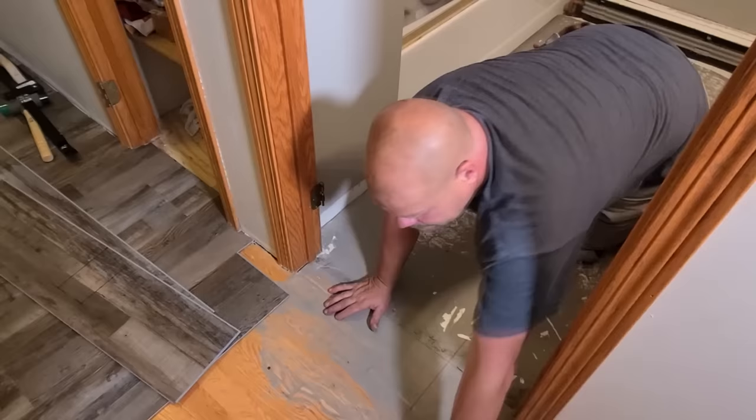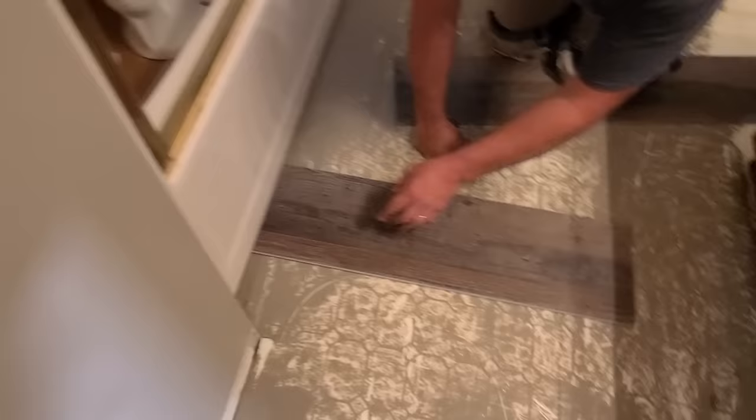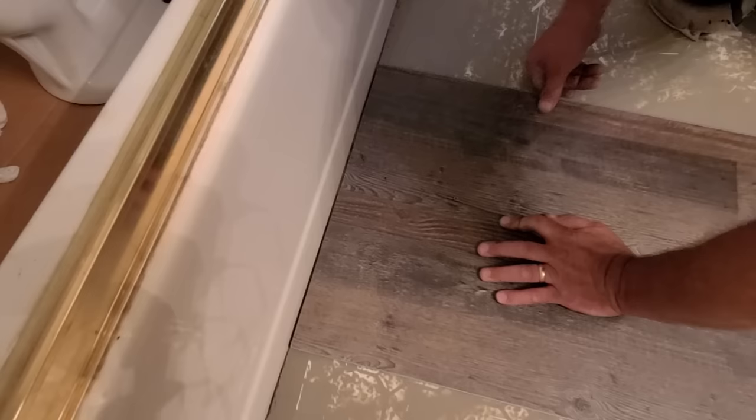Every plank has a locking system — we have the groove and we have the tongue. You always want to try to work away from the groove. This is where my groove actually is, so I would work away from it. I actually should be starting down here working towards the tub. I always like to work away from the tub so you can maintain your cut. No matter which way the locking system is going, always start at the tub. Get your eighth-inch gap so it's nice and pretty the whole way, and then finish your other cuts this way.